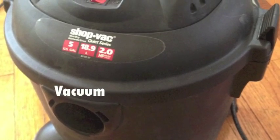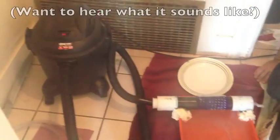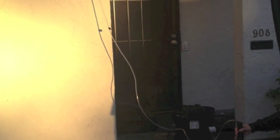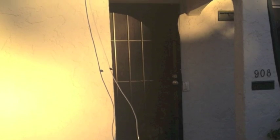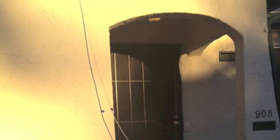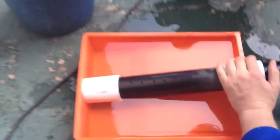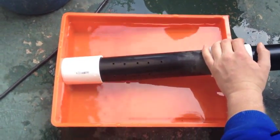The vacuum used is a wet-dry shop vacuum. The pressure drop of the vacuum is approximately 1.8 psi, which we measured in inches of water from a manometer we created and attached to the vacuum. The vacuum has to have a strong suction so that it will be able to separate the liquid from the solid.